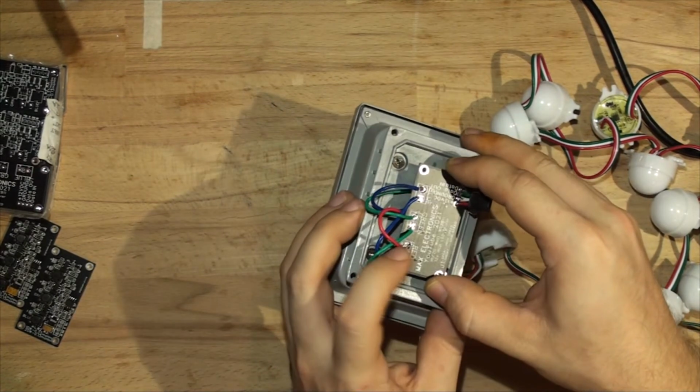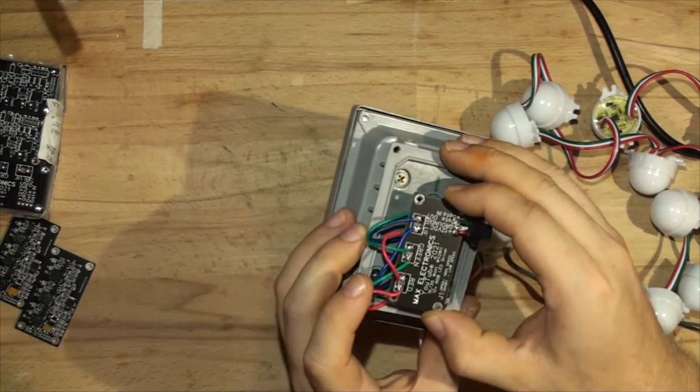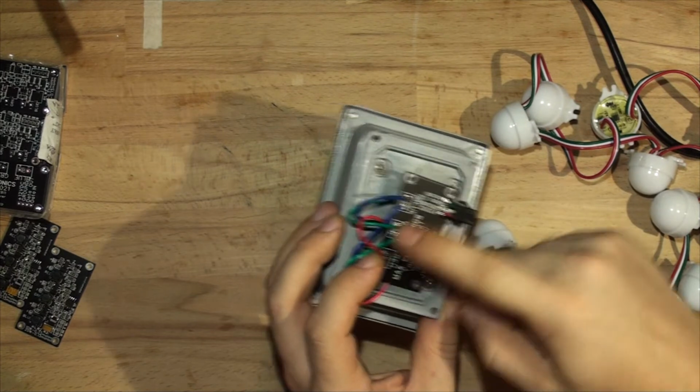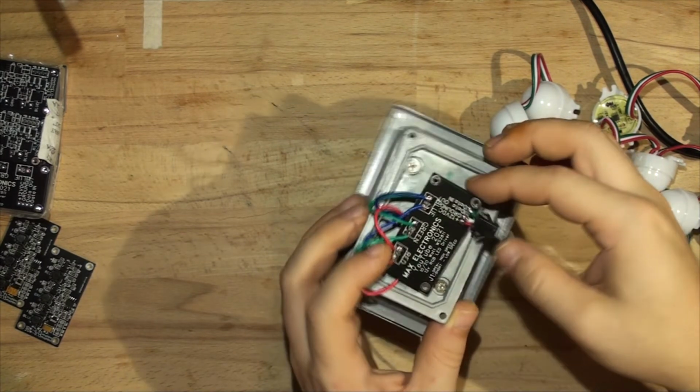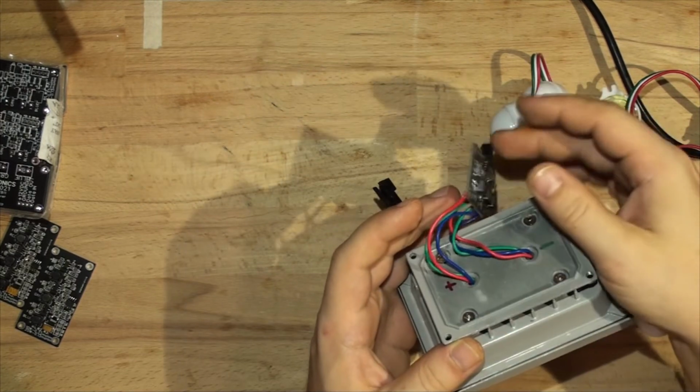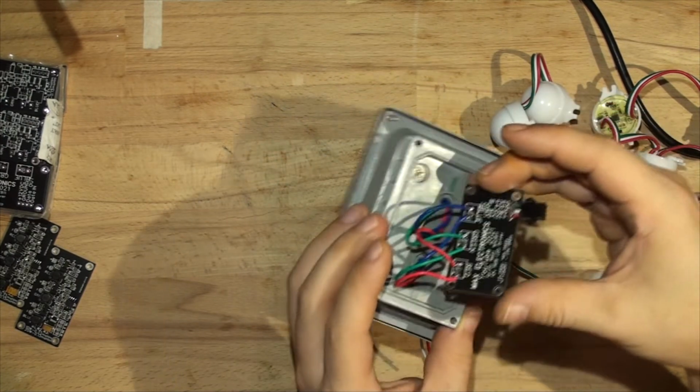And it's going to be facing again. All the components will be facing the light itself. Also, because I'll be using this outside, I'll spray protective lacquer over the top of the circuit board, so it'll coat it in a thin layer of lacquer to make sure that no moisture or anything can get inside.